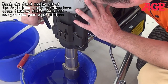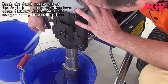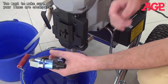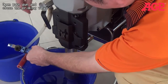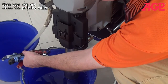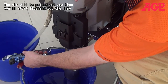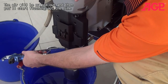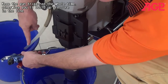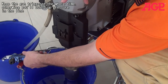Now make sure that your pump is clear and you've got clean flushing fluid coming up so you know your pump is clean. Now you want to make sure your lines are clean also, so you want to open your gun and then close the priming valve. The air in the line will be pumped out and then you'll start flushing out the line. Keep the gun triggered the whole time — you have to keep the gun triggered.